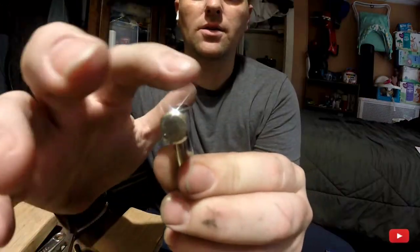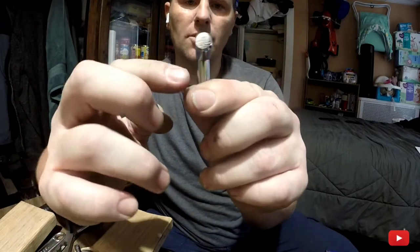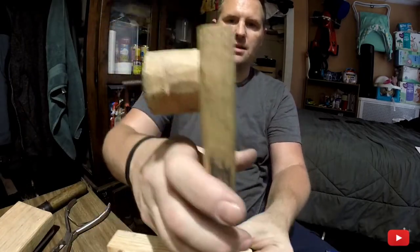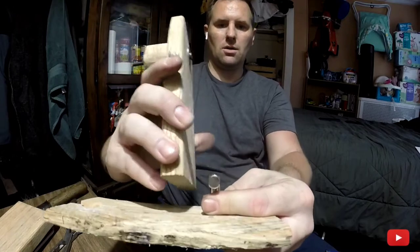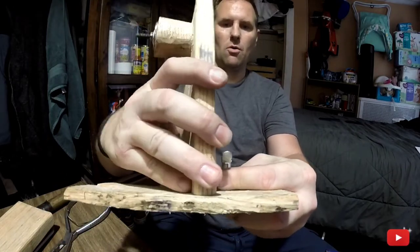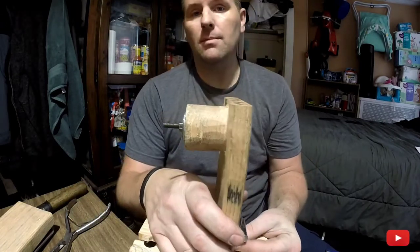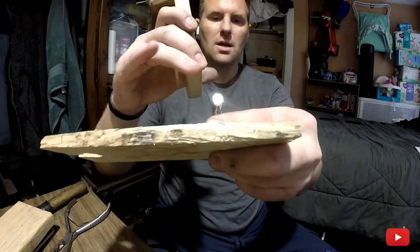I might start on the other stand for the press. Real quick — what I did is I shaved down the sides because this bar was bigger than the shaft, and I needed it all to be the same size because I can't make the top fatter to be able to pull it out, so it all has to be the same size. The reason I went with these is I want this to stay here — it's going to be bolted to this, and then this, which is going to hold the crank, is going to just slide over this and sit here. Once bolted, this is what's going to keep this from falling over or going sideways once the crank is in there. I don't want to have to bolt it on and off on the bottom every time. I'm assuming I'll take it off a lot — drill, weigh, drill, weigh — and I want to do it quick and easily.